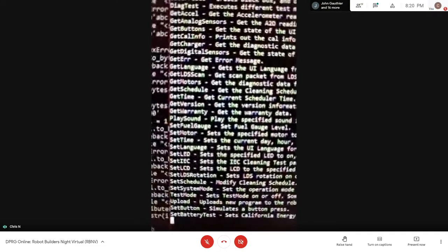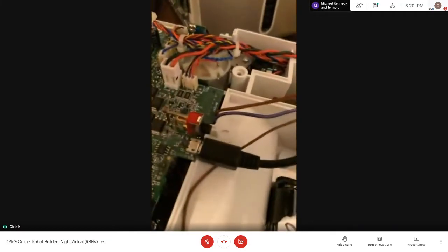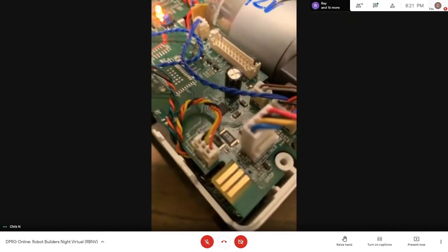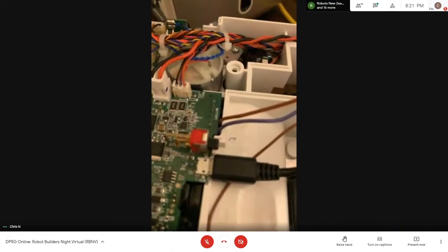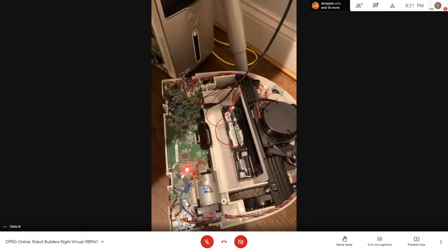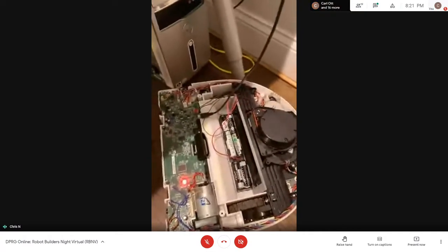And it turns out this thing comes with a, I don't know if you can see this, and it's not that super critical to read it, but it comes with this sort of quote unquote API that you can get to by connecting to a little USB micro connector on the board. And I found information online, it's also got just a plain old UART if you don't want the USB. But my thinking is, hey, I could just cobble together something on the Pi and control this over that USB connection, and basically with the quote unquote API, you can issue commands to read certain sensors. It sends you the data back, and you can issue commands to control the motors.